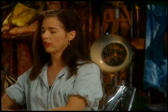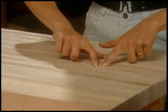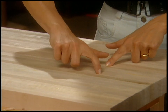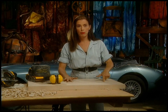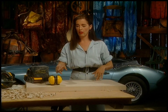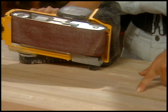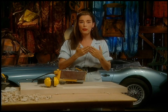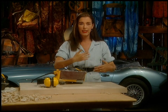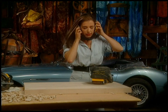Possibly a good idea to wear a mask sometimes when you're working with wood. So I've cut off the ends to make this nice and flush, and I am now at the point where I'm going to begin to belt sand the surface. Here's the critical tip you've got to know, even if you've never sanded before in your life. See this pit here? This is the low point on my board. I'm going to have to sand to the bottom of that pit. If I don't sand to the bottom of that pit thinking I'll just get that later with a finer sandpaper, I am kidding myself, because the little grains can't reach the bottom of the pit. So use the big grains to get to the bottom of the pit.